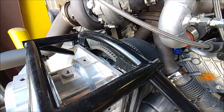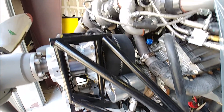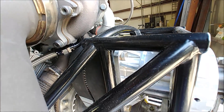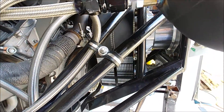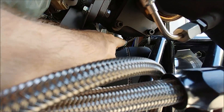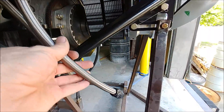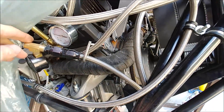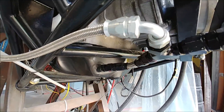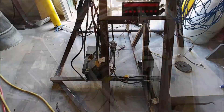You can see I've got the redrive mostly back together with the new pulleys in there — they're a little bit larger than the old ones. Because of that, I actually had to change the routing for the oil return for the second turbo. The return used to go the other way; I turned it around facing this way. It's now an AN10 line feeding into the sump directly, but I need a reducer to go from AN10 down to an AN8 connection at the Y fitting. I've ordered that, and once it arrives I'll be able to run the engine again.